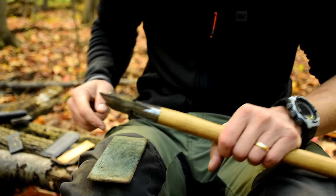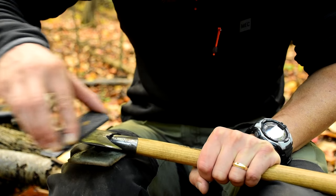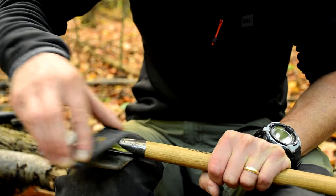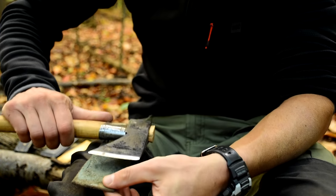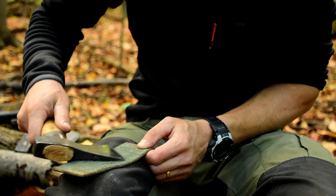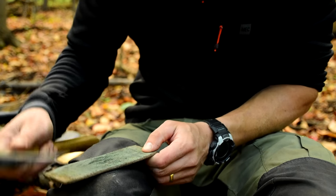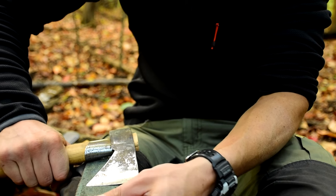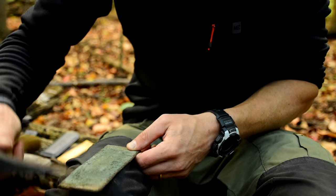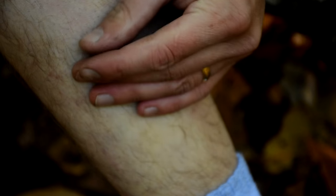I've noticed it's tearing up the strop a little, which means it's got a burr on this side — just work the burr down a little bit. The burr is just the metal folding over because you went too hard or too long on one side. And let's see if this thing shaves — there you go. Super sharp. That's sharper than when I got it.